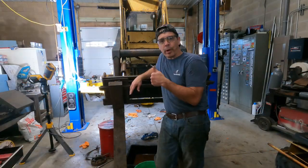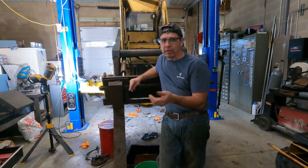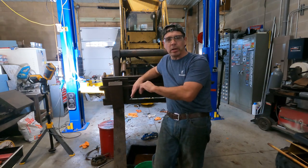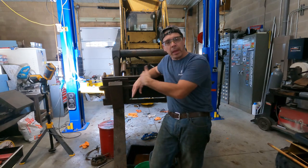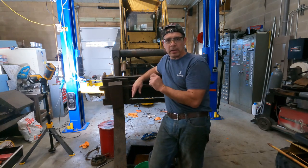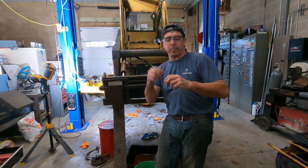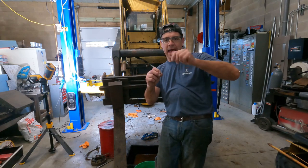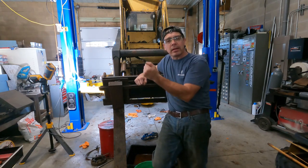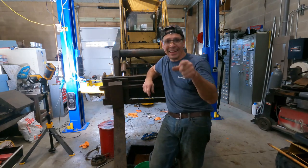Alright, so I just went through, I put on new pads, left the same rotors, they're not bad, it's not like they're warped, you're never gonna notice. Put the caliper brackets on, cleaned up everything really good, degreased, then RTV'd, and then we tightened everything up. So then what I had to do up there was I adjusted the emergency brake, and it has a knob on the end that you could spin. So I just spun it until it kind of gave me resistance and I had a good cam over effect. Okay, that's the brakes. Ha! That's the brakes.